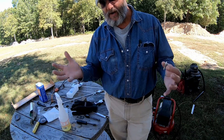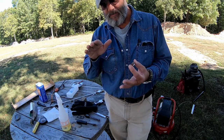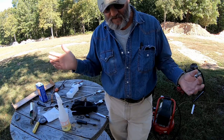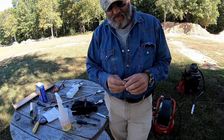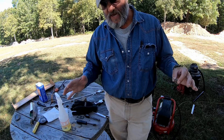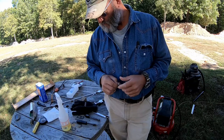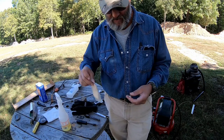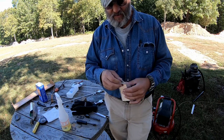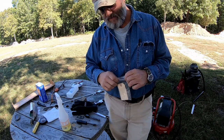You've got to take the entire housing apart on this particular furnace, and the high temp sensor is between the two sections of the heat exchanger. So I just had them do it. Brought it back and put it in, and it's having exactly the same problem. Now, they said they test ran it, and this was the problem on their test rig, and it ran fine. Well, that leaves the only other variable that I can think of as being the propane side of it.